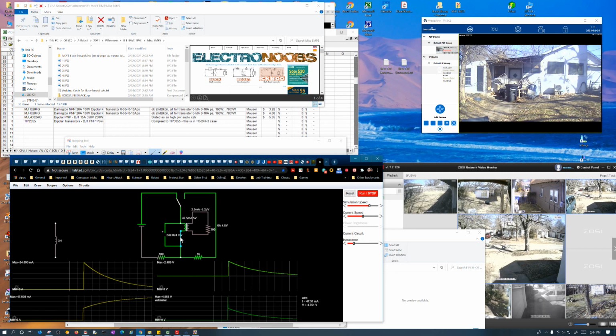Okay, I've got a basic transformer set up, and the reason I left this is because this thing behaves squirrely for some reason without it. I'll show you in a minute, but notice that this impedance and this impedance are equal. When I charge it up, this is our inductor, our transformer charging up right here, and this is its voltage. And this is our load current and our load voltage. But notice that this is like 2.5 volts. Remember, we got 5 volts here.